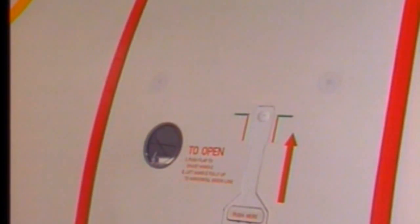If someone intends to open the door from the outside by moving up the exterior control handle, the slide arming control lever moves automatically up to the disarmed position, which avoids accidental slide deployment.